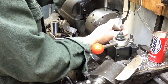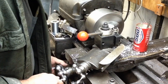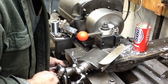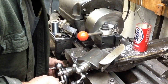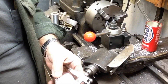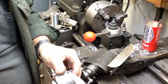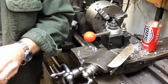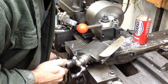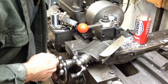This is the body of it, which is our two-inch pipe. We've just squared up the ends and we're going to face them off. Here we're just measuring it for the length. I've done all the machining in the three-jaw chuck on this - there's nothing that's really precise enough that I feel I need the four-jaw chuck for.